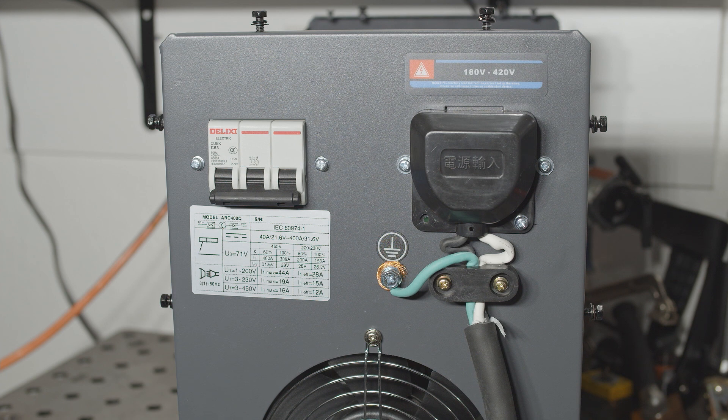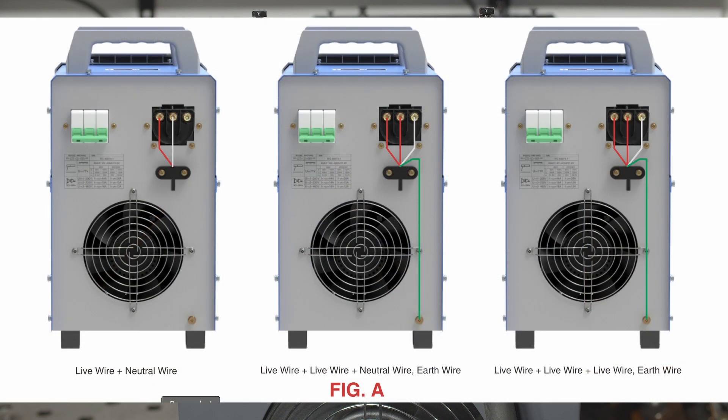The connection guide in the manual is also a little strange. Option 1 shows single-phase power with no ground, which could present a safety issue. I have no idea why they don't show a ground on that setup. Setup 2 is a single-phase setup with two legs and the neutral connected to the input terminals. Since these connections go straight to a three-phase diode rectifier, having the neutral connected along with the two main legs wouldn't really do anything. It doesn't hurt anything, but since the neutral voltage is always in phase with the other wires and at half the potential, it won't provide anything to the system.